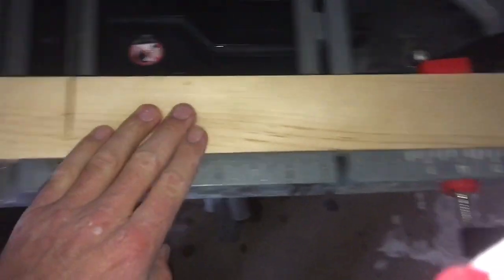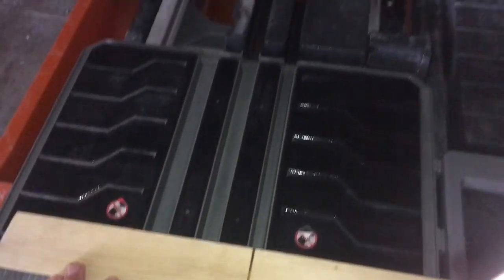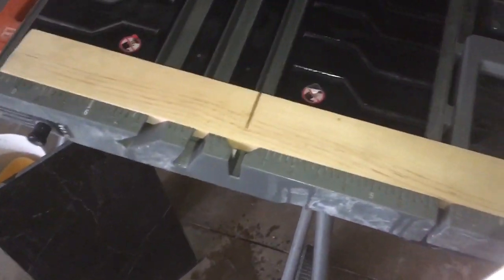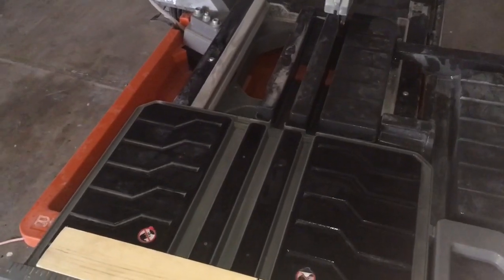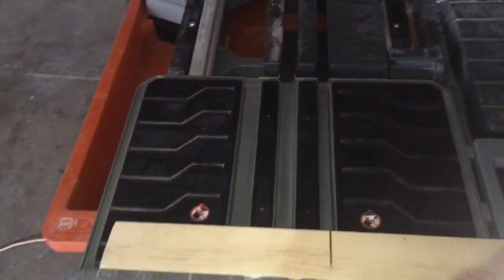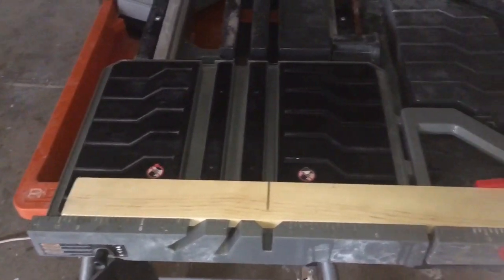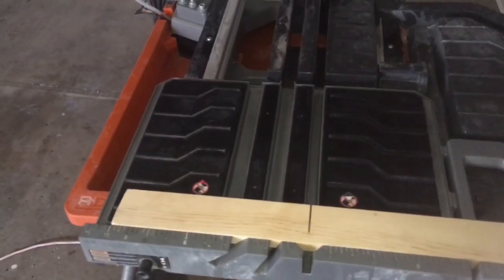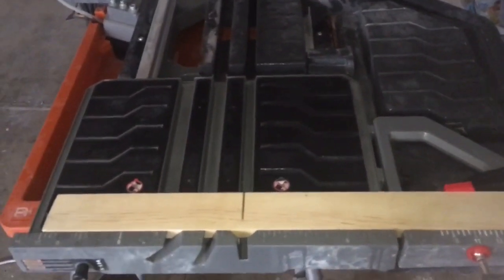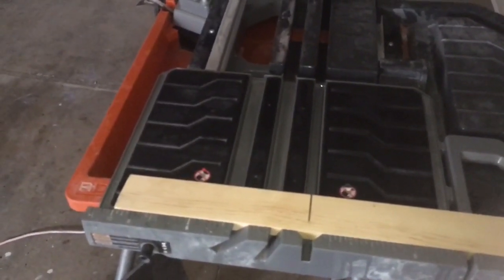When this wood gets too wet and things start to move, just take it out and put a new piece of wood — it's very easy to change out. For this saw, this is what works best. I've set up on other saws little plywood tables; they're eventually going to warp and not be good anymore. But it is cool because on a plywood table you can set up little different jigs for doing cuts. I've done projects where I needed a bunch of little squares or odd shapes, and having three-quarter ply down is really nice because you can just screw whatever kind of stoppers you need in there.